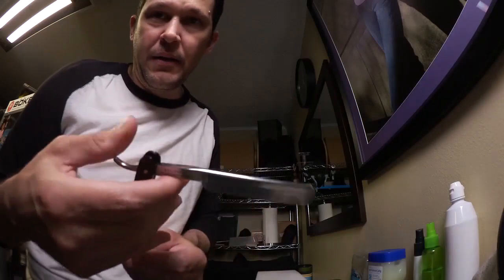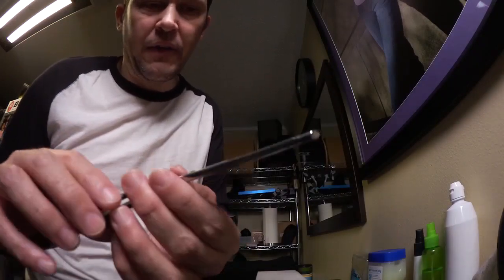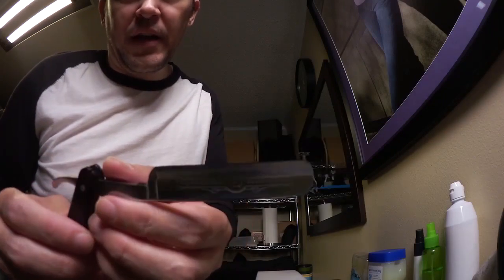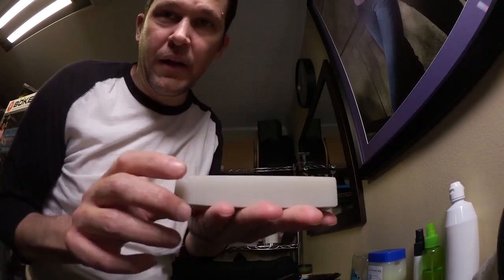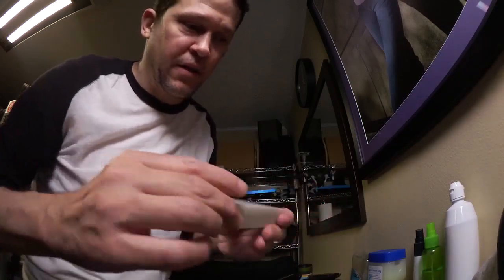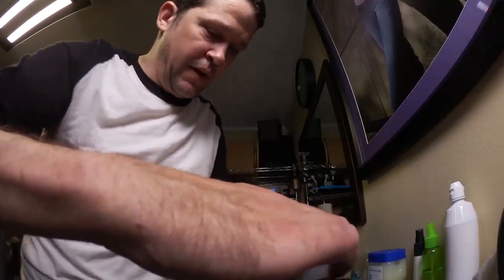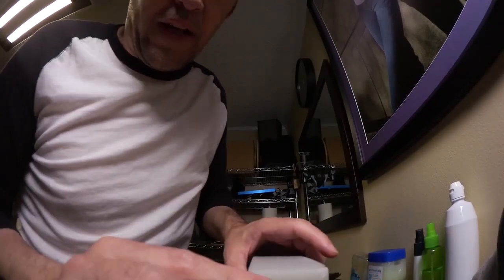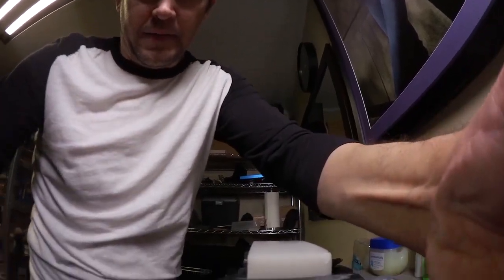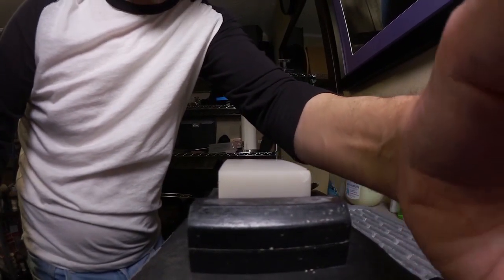So what I'm going to do is thin this customer's razor and thin my own razor. This is an NTS Solingen stainless steel one, and I have made it the concave way, but I have never sat there and truly attacked it with such a short, fine wheel like this, with this very nice curve on here. So let's get to work, why don't we? And I am going to put some Vaseline on that razor so that it resists the natural tendency for it to get a bunch of scratch marks on it.